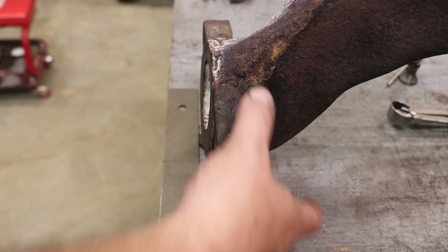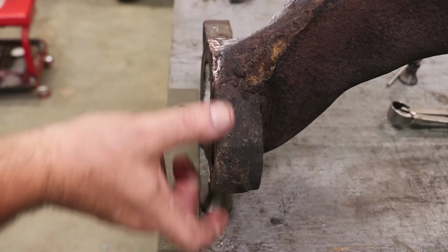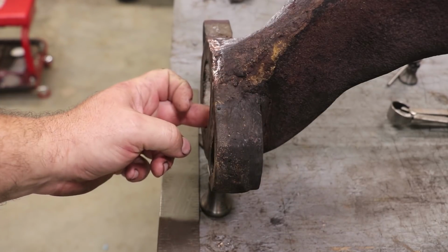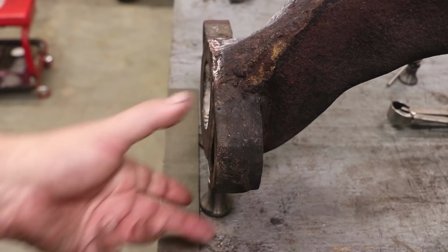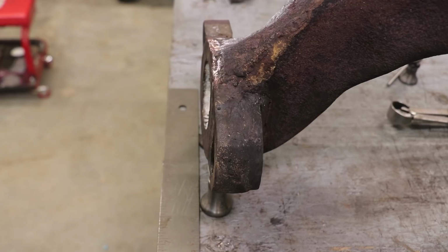And I'm going to take a whole other block and put on here. It's going to probably be even thicker than what's here and probably thicker in this direction. The idea being to have plenty of material there. And we're going to braze it back on, but before I braze it back on, I'm actually going to do a mechanical joining as well. I think what we're going to do is drill and countersink some holes, tap some holes in the casting back here, and take some cap screws through some countersunk holes and bolt it to the part in two places, and then we'll come back around it, we'll V everything out and braze it on top of that.